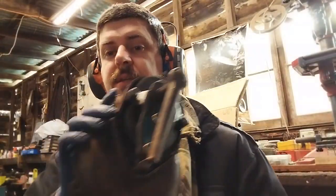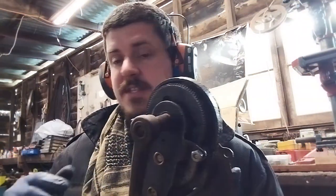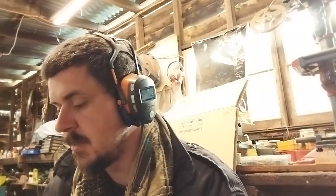The next step before I go through and properly lubricate it is that we doused this whole thing in degreaser. What that did is it softened the large clumps of grease enough that I was able to clean it out. But now there's kind of a thin sheen of leftover pockets, and that thin sheen now needs to be removed. So it'll be another pull apart, degrease everything, wipe it out, do parts cleaner, and then completely lubricate it. And then I'll be able to do final reassembly of the internal mechanism.